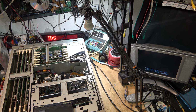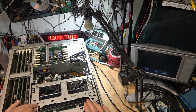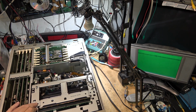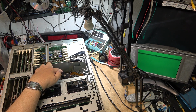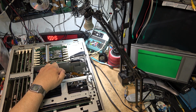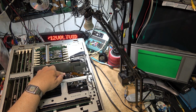Go back and put the analog tape back in. Now it slows the drum down because it's an analog tape. The drum doesn't run as fast. That's why it was making all that racket. But I don't think the top of the head drum here should be vibrating like it was. It still is. I can feel it. It's just not as bad as it was on the other tape. Something's probably twisted or bent in the drum, because this thing here seems to be wobbling.